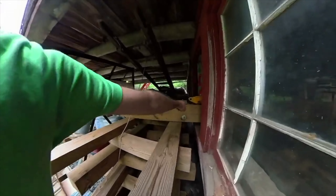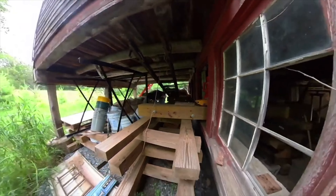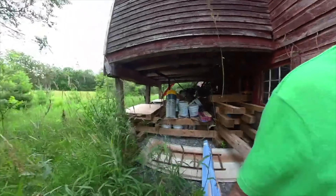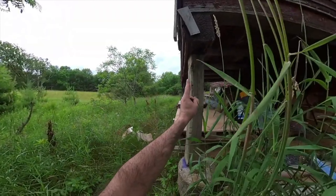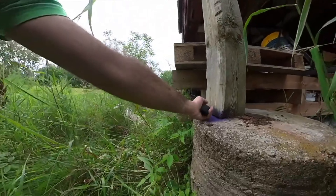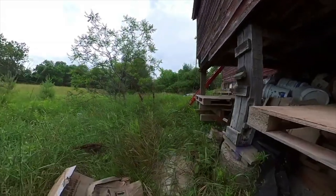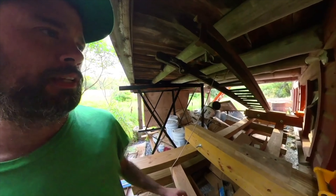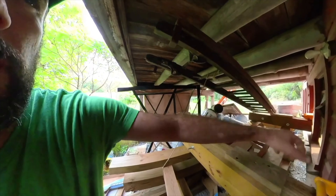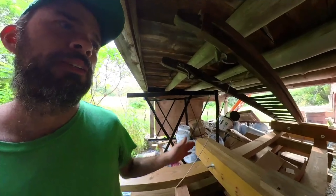You can see I have a gap here — this was up close before — so we've probably moved three to four inches there. Looking out at these posts, they are tilted a little bit and there's now a gap under here where it wasn't painted before. Right here you can see we've got quite a bit of gap, roughly seven inches. As we go down, the gap gets smaller — the corners of the barn are a lot tighter than the center.